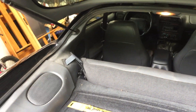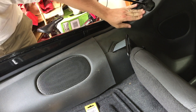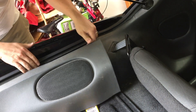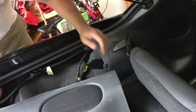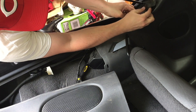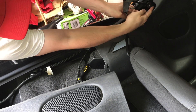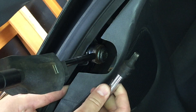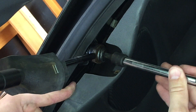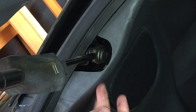Replacing them is not that difficult although it can be just a little bit tricky. We've got to get the bolt out of the shock. In order to get that we have to peel back this plastic piece and pull this panel off. There are two little clips right here, I just want to peel that back to give us a little bit of room. There's a rubber boot that goes around the bottom of the shock. What we've got here is a T50 Torx. I'm gonna put that in this bolt and it should break that loose for us. I want to be extra careful not to break this piece of plastic trim right there.